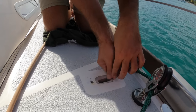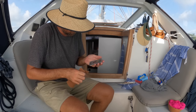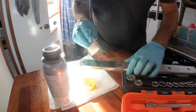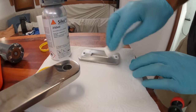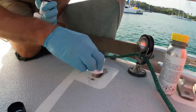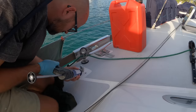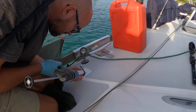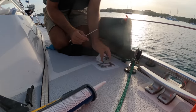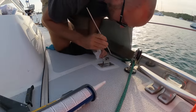As per the instructions, I sanded the hole in the deck with 80 grit and scuffed the surface of the stainless with a very light abrasive. I applied the 205 activator to both the chain plate and the cover using a piece of paper towel. I treated the fiberglass hole with the multi-primer and also used 205 on the painted deck. I then waited 30 minutes after application before busting out the Sikaflex 291. Application was as always super easy, and then there was just a little bit of cleanup.